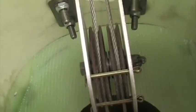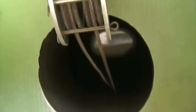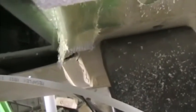There's a view from inside showing the elevator cables routing down the inside of the fuselage. I've also started routing the brake tubes, the nylon brake tubes. I'm running them up the front face of the undercarriage. Remember, this is the nose wheel Whisper. Things will be slightly different for the tail dragger. And then I'm routing the tube below the carry through spar and drilling a hole for it to come out and meet up with the master cylinder at that point. And the same for the other side.